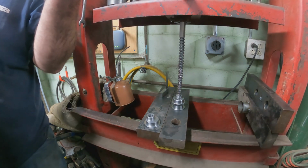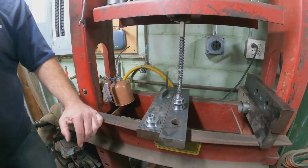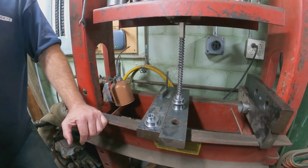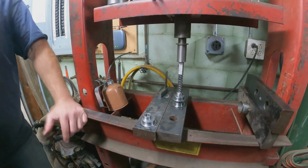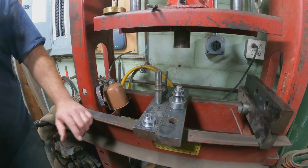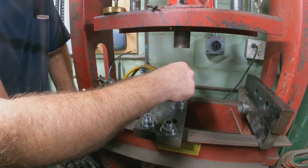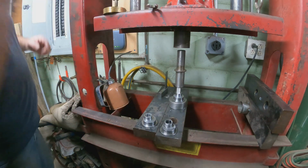And the drill size for that, by the way, is 17/32. I had it drilled to 1/2 inch, so I had to go ahead and get it re-drilled out to the right size. I was not aware of that whenever I drilled that originally. So we have to take our guide off here so we can get enough travel. And it shouldn't be much more that it has to go through, because it's pretty much there now.